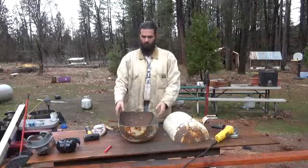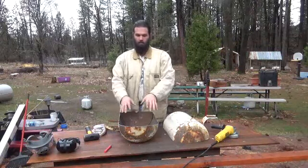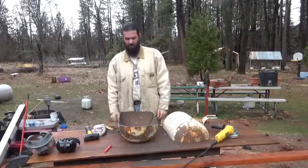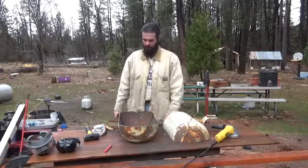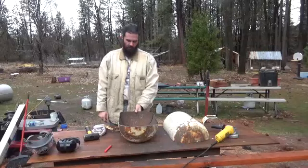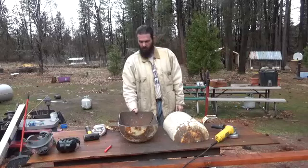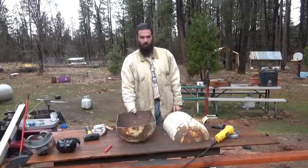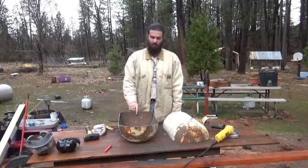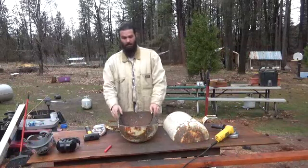If you wanted, you could make this deeper — just cut it a little higher on one side and you'll have more height on it, but that's not 100% necessary. One of the reasons why I cut it straight through the middle of the threads instead of just cutting around it is if I have something on bar stock, this will be a good place for it to rest because it won't want to shift around all that much. So I'm leaving this here; I'll go through and take a file and smooth it out, but other than that I'm not touching it.